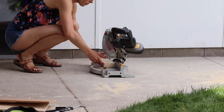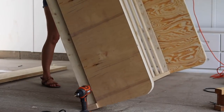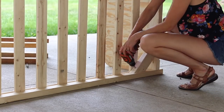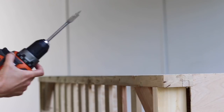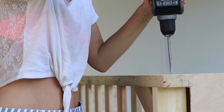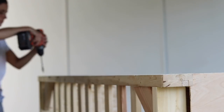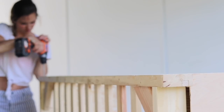At this point, I was feeling slightly concerned that my bed swing wouldn't be rated for the amount of weight I was hoping for — which was, no joke, 1,000 pounds. So I decided to reinforce the 2x4 box by cutting out 45-degree angle pieces to put in the corners and really make it sturdy, like they do for tables. This really did add a lot of stability. I cut some more 2x4 blocks with 45-degree angle sides and put them in the corners, screwing them into the 2x4 frame. While I had my bed swing on its side, I decided it was time to drill holes for the ropes. I'm using a spade bit — also known as a paddle bit — at one half inch, drilling that down. Whatever rope you decide to use will determine what size hole you need to drill. I tried to get my hole as close to the 2x4 connection as possible — that'll be the strongest — and I made sure to drill through the actual meat of the lumber instead of near the grooved area.